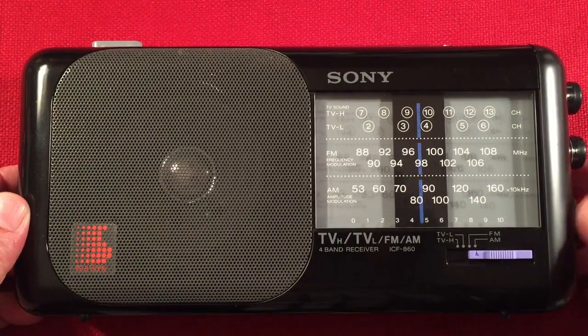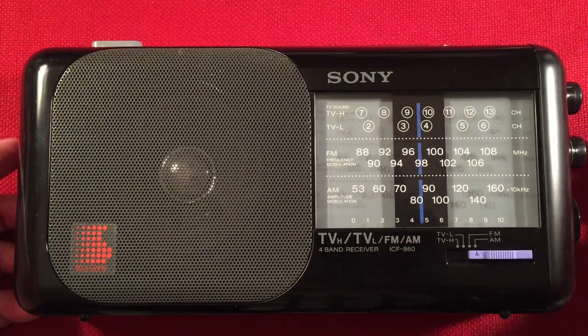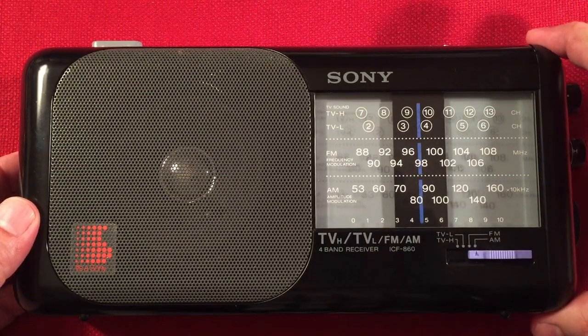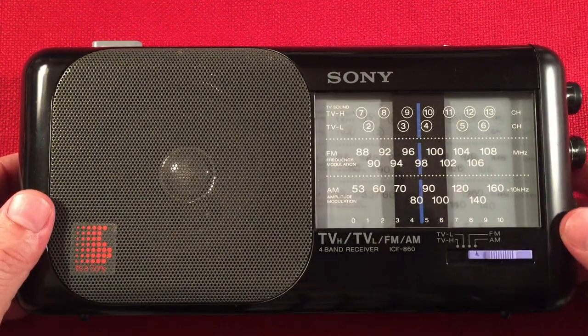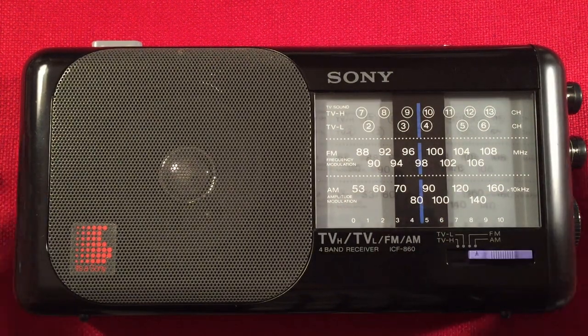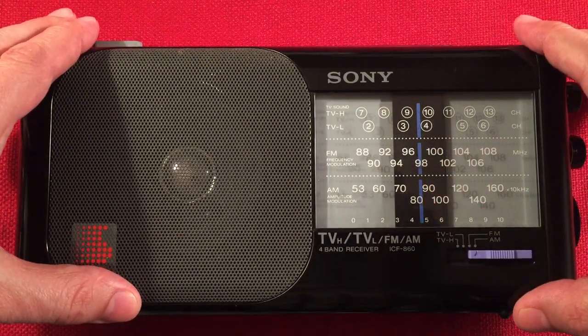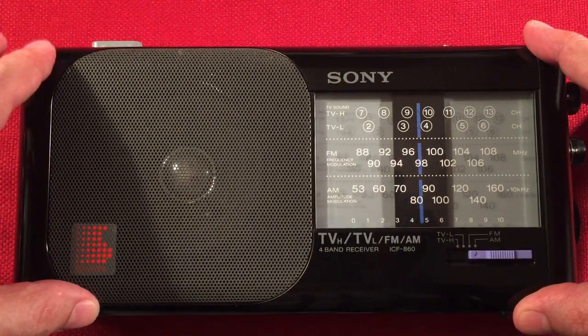That's the nice thing about it, you can get in there and clean those potentiometers easily. Like I said, just four screws. Take the side plate off after you take those three knobs off, and boom, this comes apart. No problem. Two screws takes the radio module out. It's just a fantastic radio. I love it. And you can get to this power switch to clean it without having to remove the AC board, which is a nice thing.